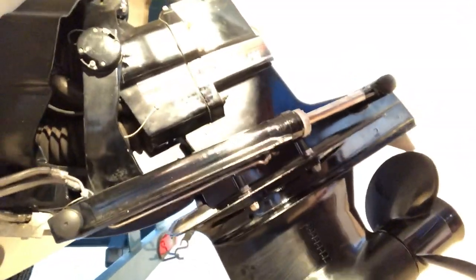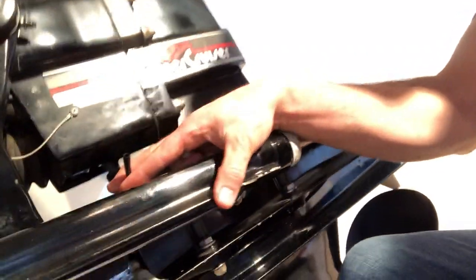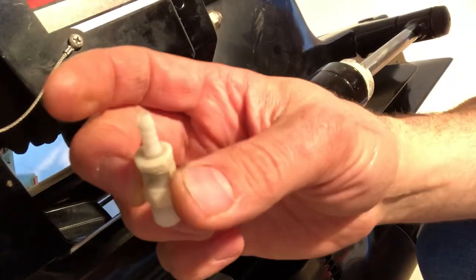The other thing I discovered was that the little hole on the lower unit was plugged full of dirt and mud, and it wasn't allowing it to function properly. Here on the outdrive, on the front edge towards the boat, you'll have to tilt your outdrive up as high as you can. There's a rubber hose coming down into the front part — that's where this piece hooks to the rubber hose, and then the bottom part is screwed into the lower unit.